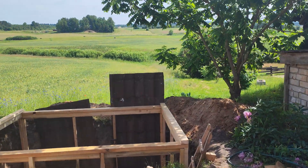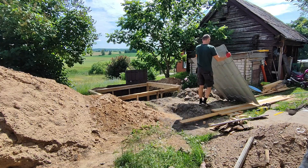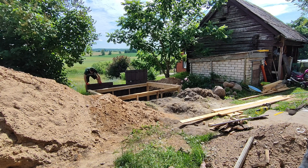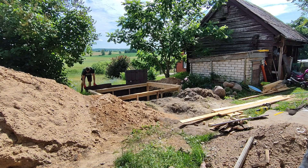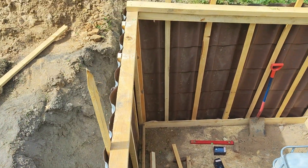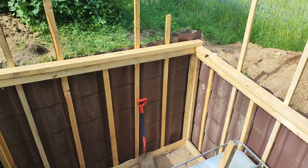After completing the frame I start putting up the roofing sheets left over from my house and use those sheets as the walls. However I discovered that the sheets are too weak to withstand the ground pressure, so I added additional wood every 30 centimeters for support.